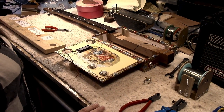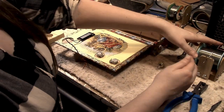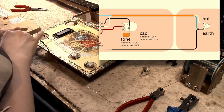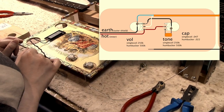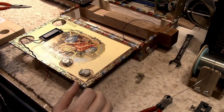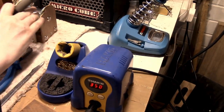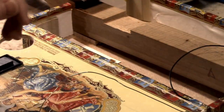Okay, we're going to start wiring this up now. The order I'll follow is: first, wire the two pots together; then introduce the pickup wire; then add the capacitor from another pot; and last, connect the jack socket. It doesn't matter which order you do the process in, but first I'm going to use solder to tin the little tabs on the pots.